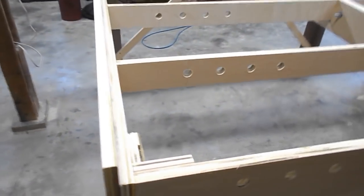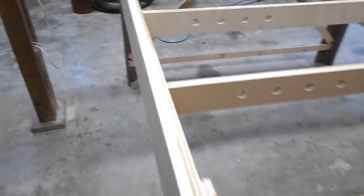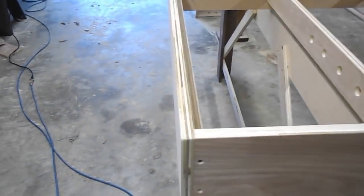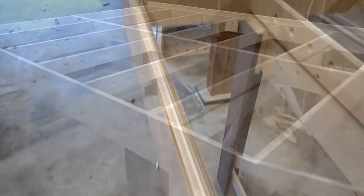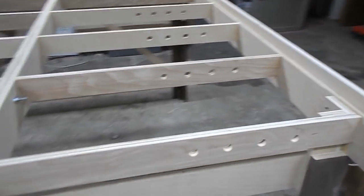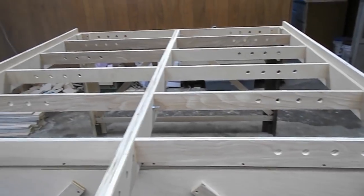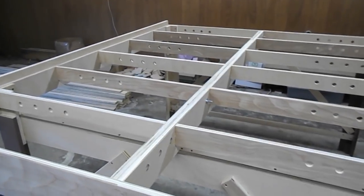The specifications for this bench work call for a six-inch side rail with half-inch plywood and one-inch foam inset, which is why I have that lip around the edge. The two side rails are permanently attached, but the end one is just screwed from the inside so it will be taken off for transit. The next stage on this project is to put the bus wires in, but I don't yet know what colour wires he wants me to use. So just like the other railroad, I am down to waiting for information and I don't think I can sensibly continue on either project until I've heard back.